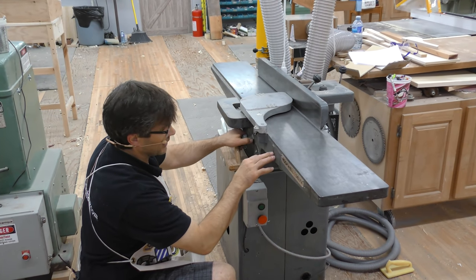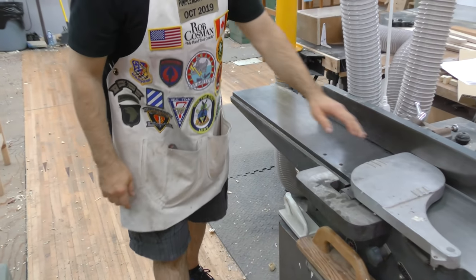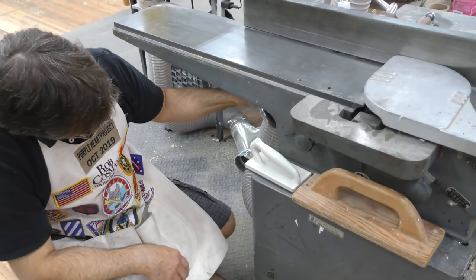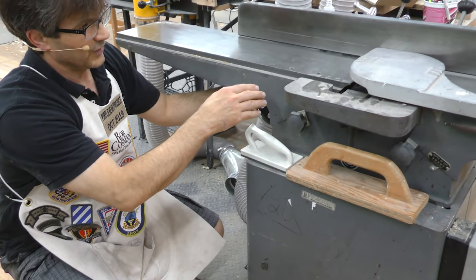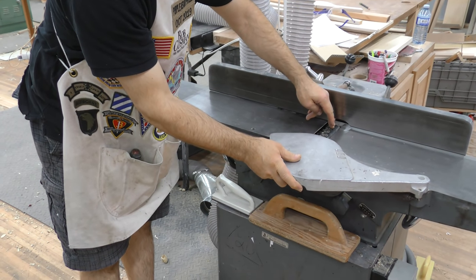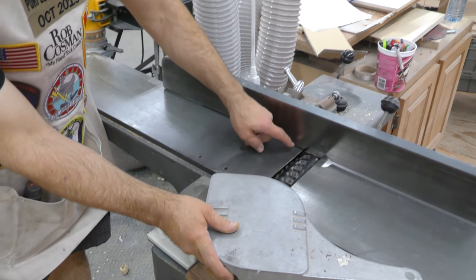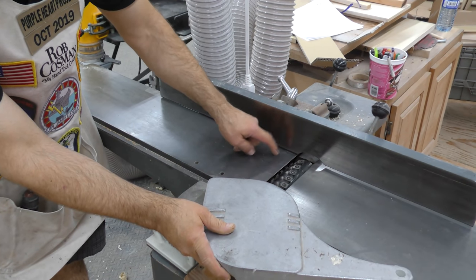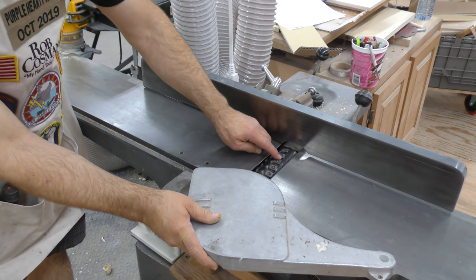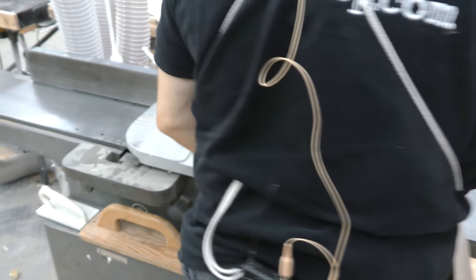You can lock the table — I don't bother locking the infeed table but I do lock the outfeed table. The significance of the outfeed table: you want to line that up perfectly with the top of the cutting circle. You loosen the knob and use a hand wheel to move it until when the board is coming across the infeed table and goes over the cutter, what's been removed by the cutter is accounted for by the outfeed table. You don't want to see a gap between the newly cut surface and the outfeed table, nor do you want the board to ride up on it. It takes a little work but it's not something you can't easily learn.